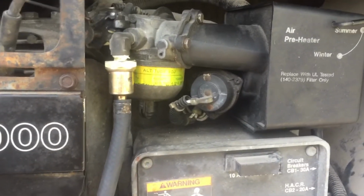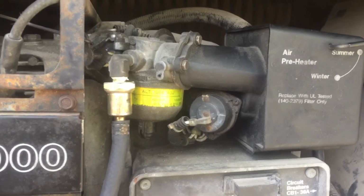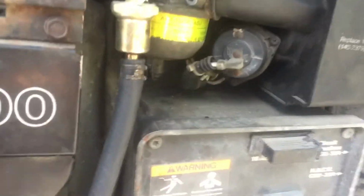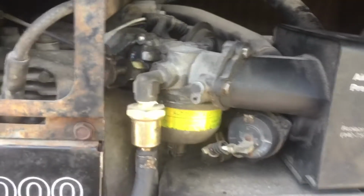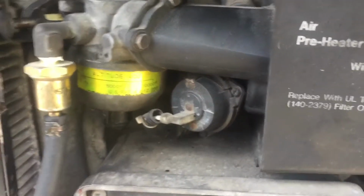So the problem was clearly that my fuel pump was overheating and not working again until it cooled down. So I needed a new fuel pump. So I put a new fuel pump on it, and I ordered one because I didn't want to pay the overpriced Onan charges. I just ordered a generic 3 to 6 PSI because the owner's manual says do not use anything stronger than 6 PSI, but it's supposed to run at about a 3.5 PSI average.